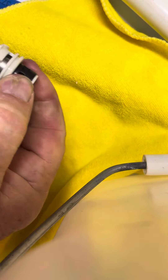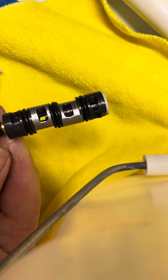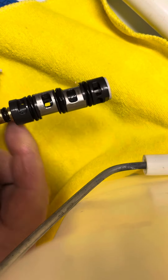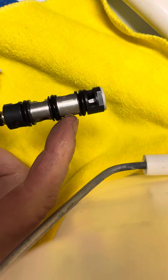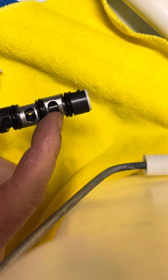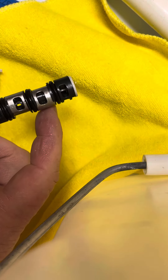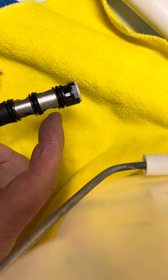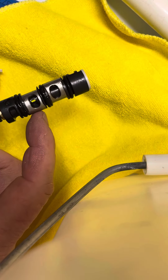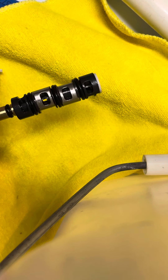I found out pushing through here — I've got the hot, this is the cold — something has shifted. There's no hole for that water to come through and engage and get up to the top. Only hot. So I've got to take this back and get something new.